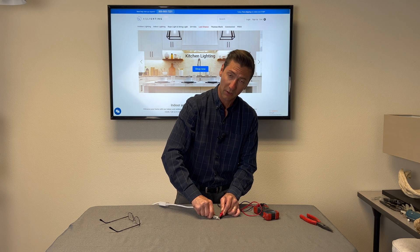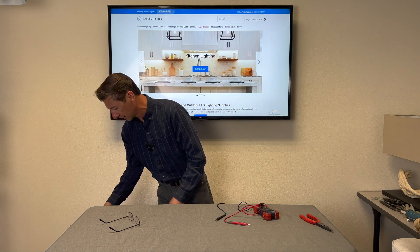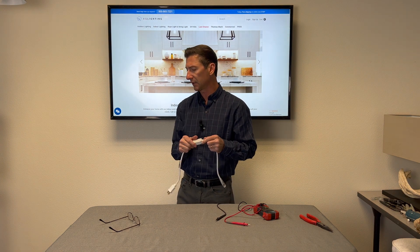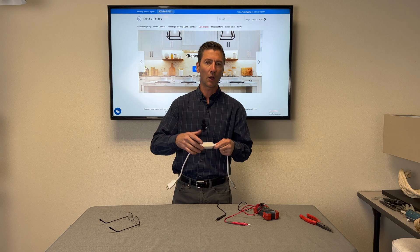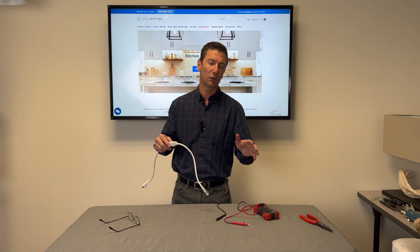Let's take another look at the cord alone — I'm still reading a little over 104, just under 105 volts DC. It's hard for me to explain; I'm not an electrical engineer. It could be strictly the rectifier, a difference in the rectifier, or possibly the rope light itself. Hopefully this explained a little bit more about the power cord and the readings you should be getting when troubleshooting your rope light.